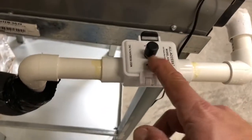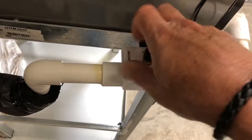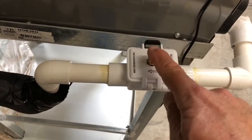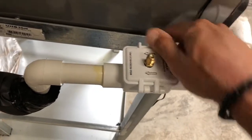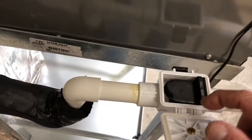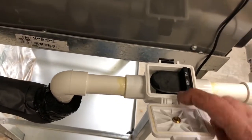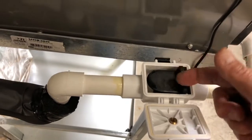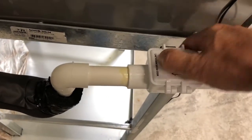The flapper inside is used mainly for air conditioning technicians that want to use nitrogen. They can hook up their nitrogen bottle to this with a refrigeration fitting, and when they blow in, it pushes the flapper down and allows pressure to go straight out and not back the other way. It has a safety built in so that anything over 30 psi opens the flapper and won't allow anything to damage the line.